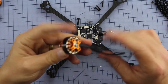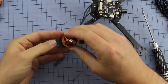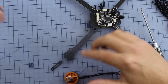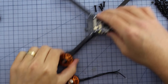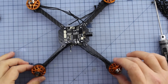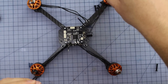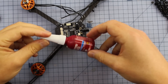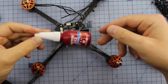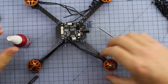Our next step is to attach our motors — very easy. You'll notice the motor has three screw holes and the arm has four, but you only need three. Run the motors across the arms toward the ESCs. The ones with black tops go on their corresponding arms, and the silver ones go on theirs. Screw them down using the little screws in the bottom, making sure they're not touching the windings. A tip: this isn't included in the kit, but a little bit of Loctite is important — it stops your motors rattling loose when you're flying. So I'm going to put a little bit of Loctite on my build as well.